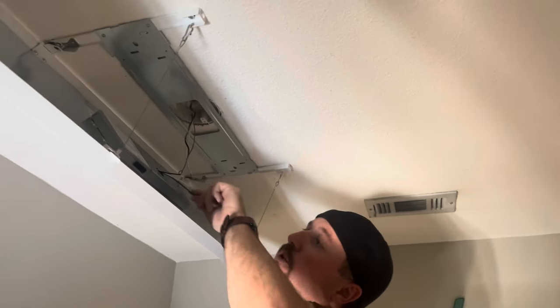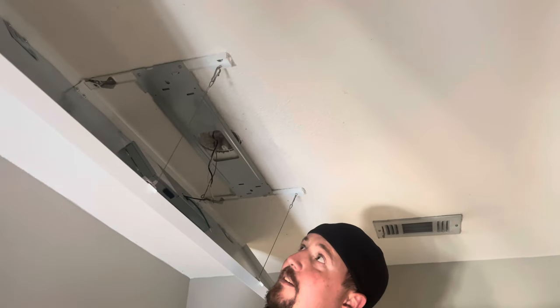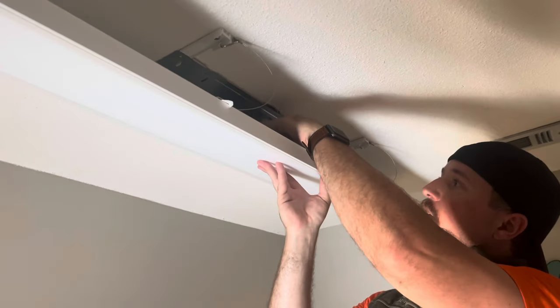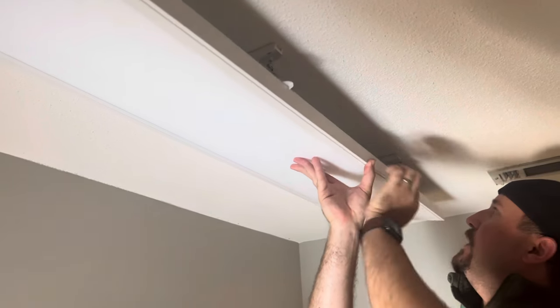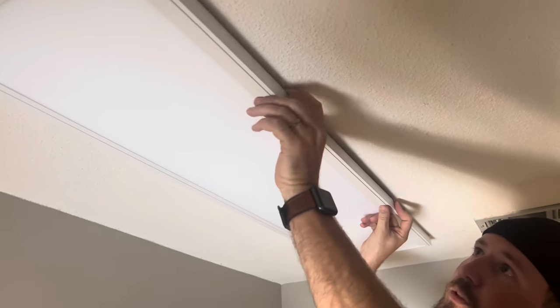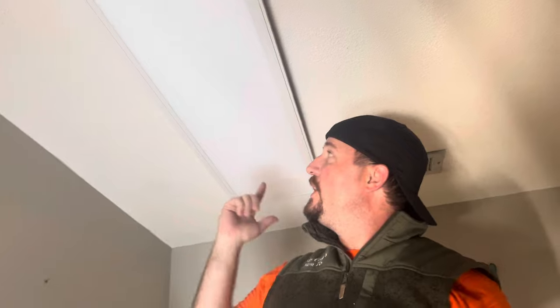Now this lets you go ahead and address putting your wiring together and wiring properly. Be sure to read the instructions. If you're not comfortable with this, hire a qualified electrician. We're going to get these wired together and then we'll show you how to seat it. Once you've got everything connected, make sure the latches are in the open position and nothing is hitting anything going back in your junction box. Push these guide wires inside, press it up, push it in, make sure you're locked. We'll go hit the breaker and see if it works.